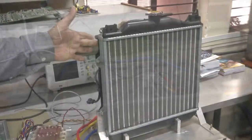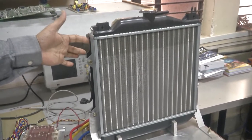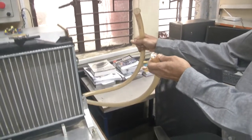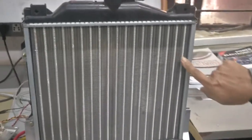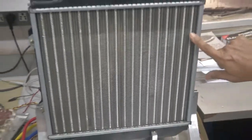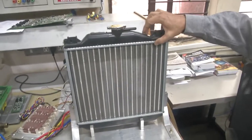This is what you wrongly call an automobile radiator. It does not radiate, it is just a heat exchanger. From a liquid surface, we have these 2 pipes. What you need to observe very well is that there are small parallel tubes here. Typically, to keep the cost low, they are aluminum tubes, and also they are finned and closely spaced. And these 2 important things: this is called the top collecting header, this is the feeder header.